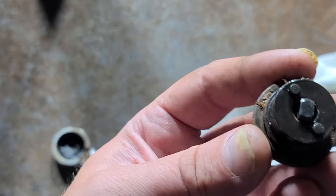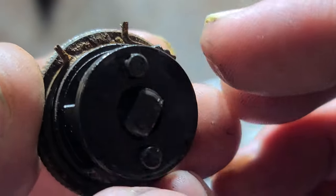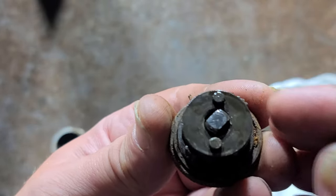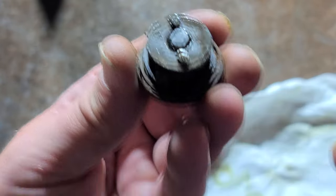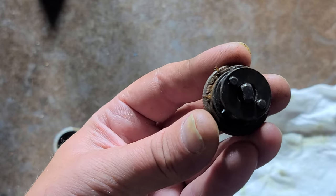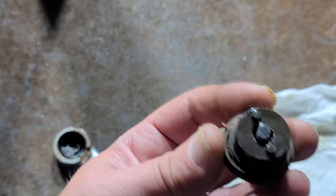The intention isn't to make double the teeth — it's just to make them stronger, because these types of rocking pawls versus like the New Britain design put all the load on these pins. I actually did a video about a flex head ratchet Napa where it had failed. It was a dual pawl and both of those little pins sheared. A very tough ratchet will be the anvil that shears. There's been a lot of ratchet failure testing videos on YouTube, and a vast majority of them it's the anvil that fails, and it's how I would expect it.